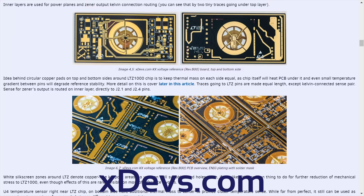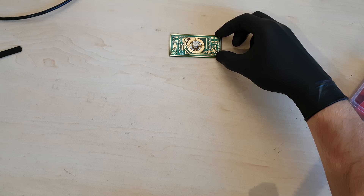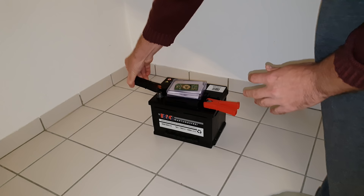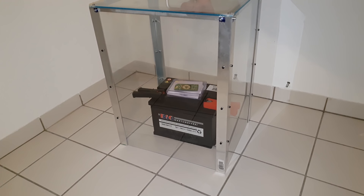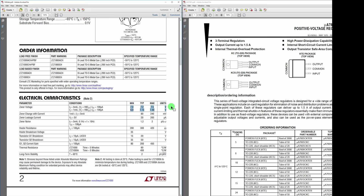There's a lot of science involved and some special components. In addition to the four-layer board, it takes a special voltage reference IC and some custom-made precision resistors with a six-month lead time just to get started. Then you have to keep it powered on for months or years to reach peak performance — and peak performance means it puts out something between 7 and 7.5 volts. That's quite a loose tolerance for something calling itself an ultra-precision voltage reference. Even a 78-series voltage regulator has a tighter tolerance than that.